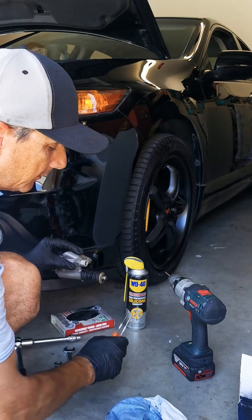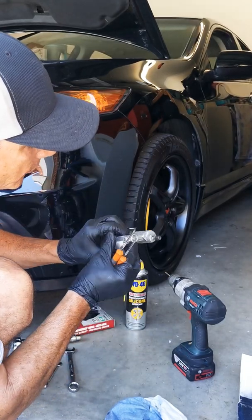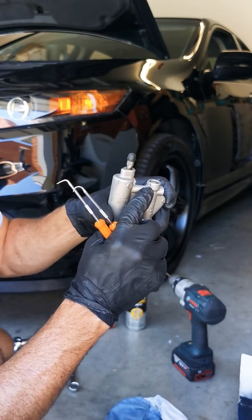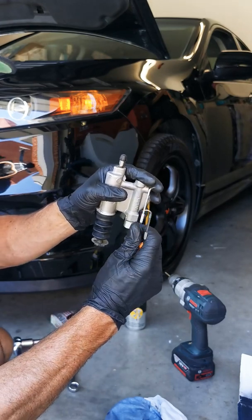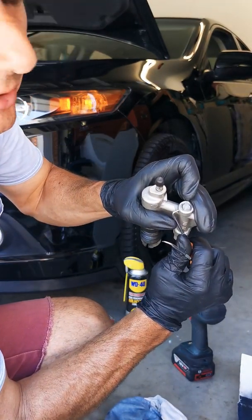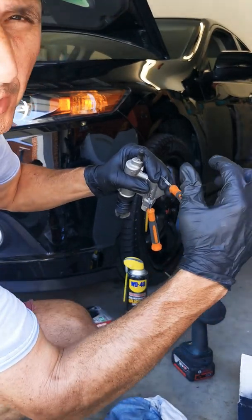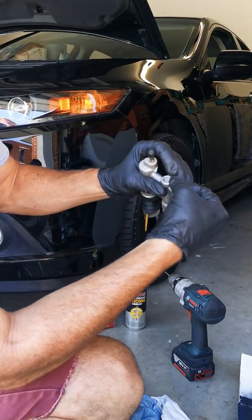Once that's done, all you need is your drill. In the back of this c-clip channel, I've drilled a small hole — I started with a 2 mil and went to a 3 mil. All you have to do now, with your hand over the top to make sure the c-clip doesn't spring away, is just push that, and you can see how the c-clip has started to pop out of the recess. Then all you do is grab your other little tool and, while keeping your fingers over it, just lever it up so it'll flick out. I've just done it — that c-clip pops right out.